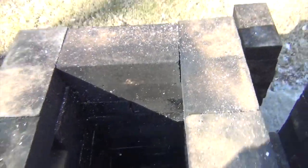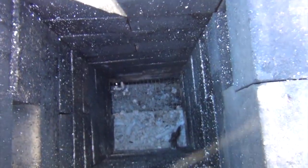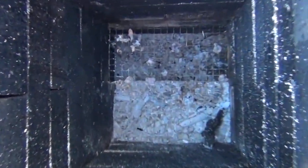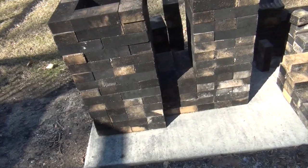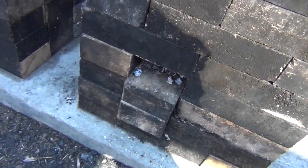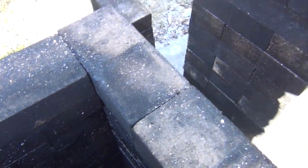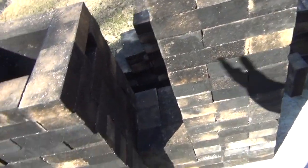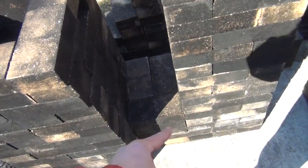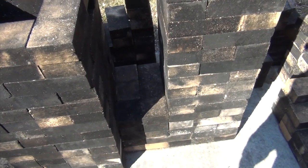But the problem was in the last example - and there's a grate in here, I'll explain that in a moment - it wanted to burn up. Even though my air channel was there and it only had to go across one brick to find the riser in the stove that worked, I had to move this out to fit a barrel on top. I never got to the barrel because this failed. Just adding that little bit of what they call burn chamber, which really isn't necessary in a rocket stove, it killed the draft.